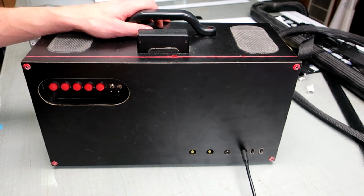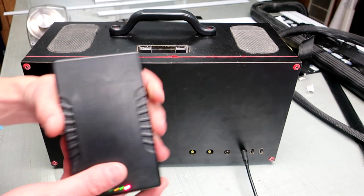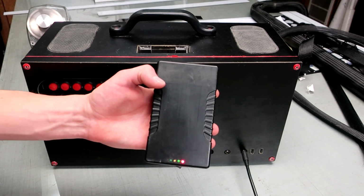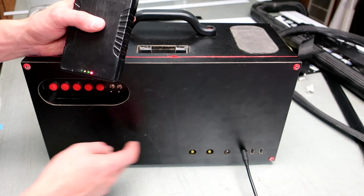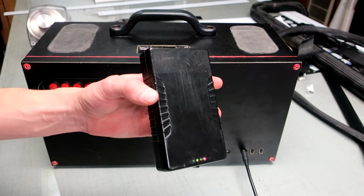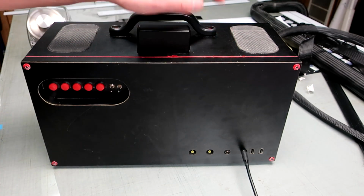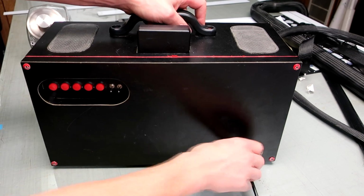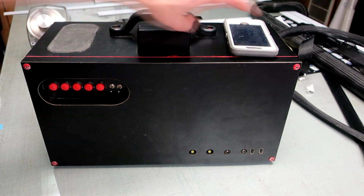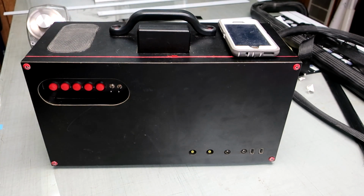And so I just always have this plugged into a 12-volt supply, and that's really nice because this is actually designed for like a 12.4 volt charge to fully charge the lithium cells. But by just charging it to 12 volts, I'm undercharging this just a tiny bit, so it'll last longer. So anyway, that works out really nice. And then I've got 2 USB ports so that you can charge your phone while you're listening to music. So that's all very good.